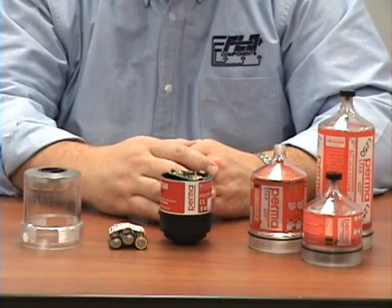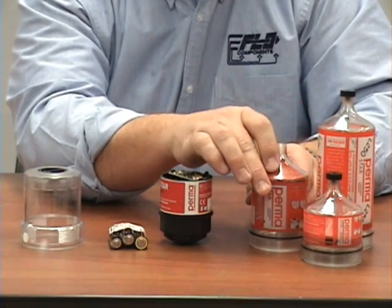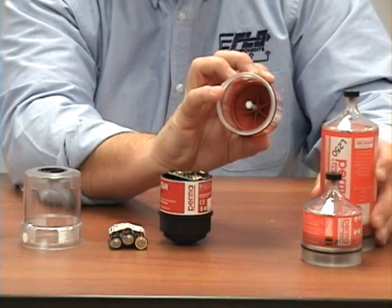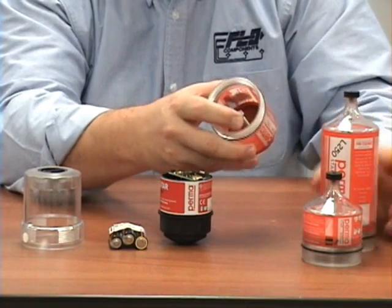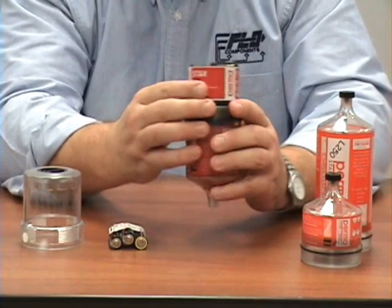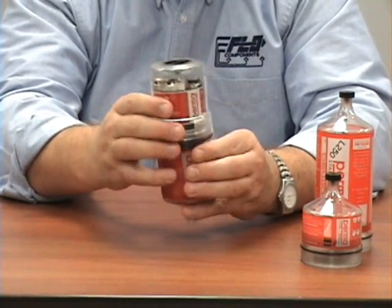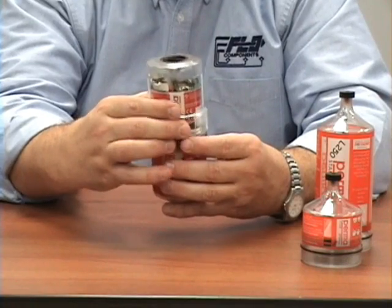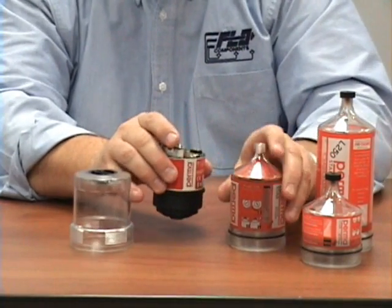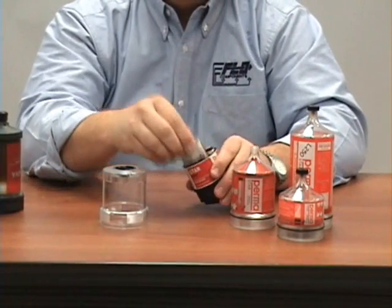Dealing with electromechanical drives, we have our lube cups which come in either 60, 120, or 250cc capacity. The lubricant is filled through the bottom and there is a piston located at the top. This bolt is threaded to the top of the piston, and the mating drive fits in here. It has a battery pack that goes in, and then your assembled unit looks like this. You can use the same drive for any one of these three cups. The lube cups themselves are one-time use — the replacement lube cup comes with the cup pre-filled with the proper lubricant and a new battery pack.